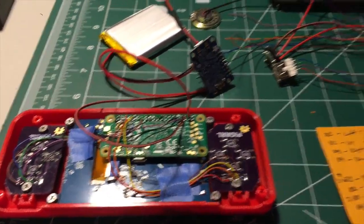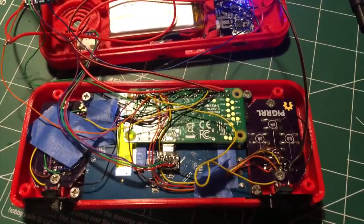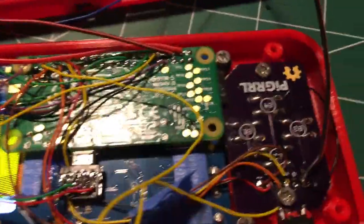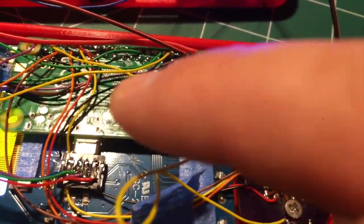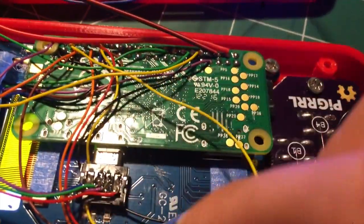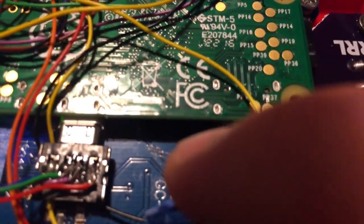One quick issue I had last night trying to put this back together: I couldn't get the audio to work. I checked all my pins and made sure everything was plugged in correctly. What ultimately ended up happening was I forgot to cut GPIO number 18 — just like on the 2.2-inch display, on the 3.2-inch there's a little pin you almost have to just scrape off and disconnect. That's underneath the Pi Zero, which is problematic. Once I found where it was on the board and scratched it off, the sound started working.